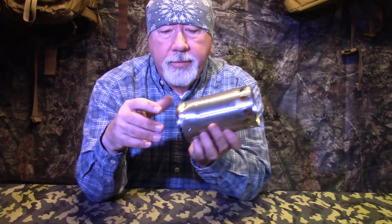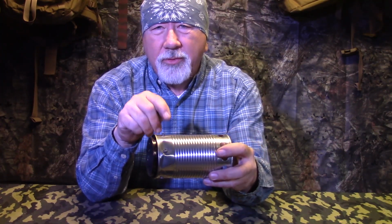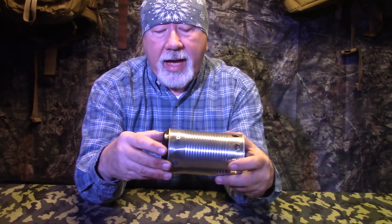All right, guys, so there you have it. It's pretty simple to do, but I'll be honest with you, there's a couple things that I would do different the next time. Number one, I would drill the holes in the small can a little bit bigger. And I would also probably, for the gasification holes, locate them further down into the burn chamber to where they're not sticking out here, just to give it more of an opportunity to gasify. But you saw how well it did burn.